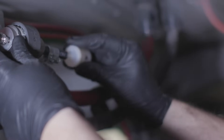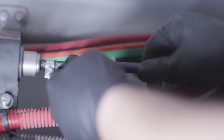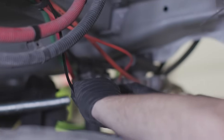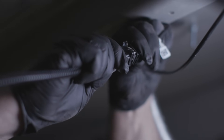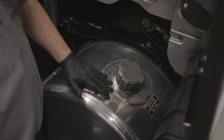Install the fuel filter vertically or horizontally between the tank and pump. Check to see that the direction arrow on the filter is pointing in the direction of the fuel flow. If possible, install vertically. If space doesn't allow, don't rotate more than 90 degrees away from vertical. When the fuel lines are connected, run the wire harness from the fuel pump to the main wire harness at the bottom of the heater. It is also important to add a warning near the fueling cap to remind the user to shut the heater off during refueling.